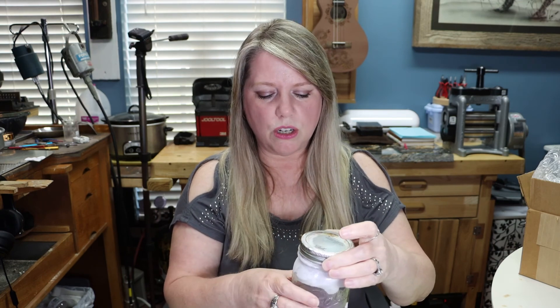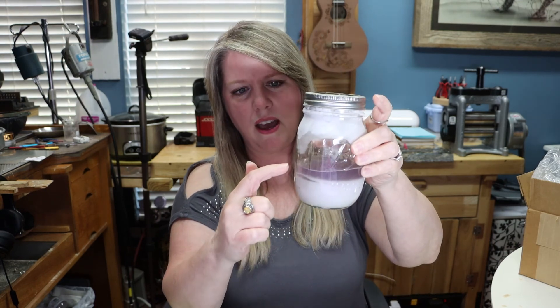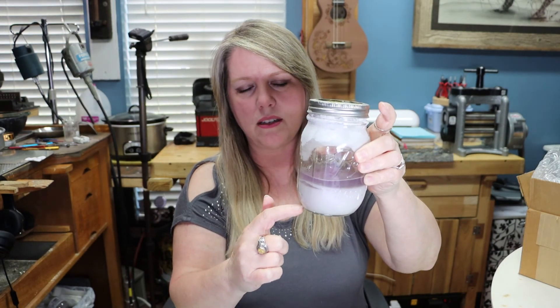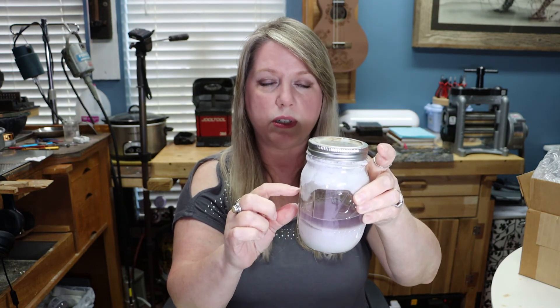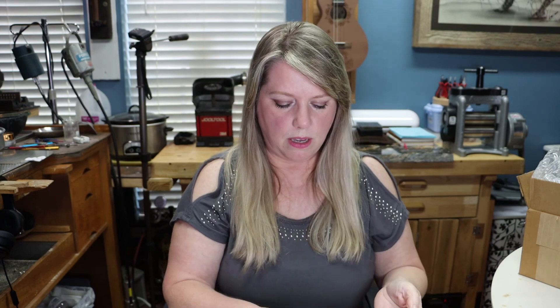You can just clean off the extra crud around the lid when you have it open. You can see that I have a lot more boric acid in this one than denatured alcohol - all I need to do is add some more denatured alcohol the next time I use it, and you'll find that you'll have to do that over time. So make sure you're putting a barrier flux on your pieces when you know you're going to be heating them for some time, and that should help you greatly reduce - maybe not eliminate, but greatly reduce - any fire stain and fire scale that you get. Good luck and I hope this tip helps.